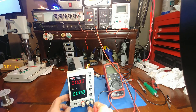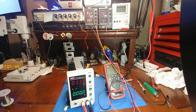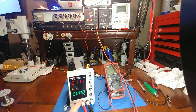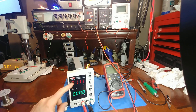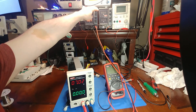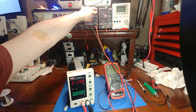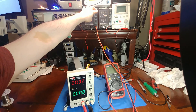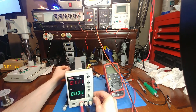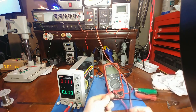I'm using my own power supply to feed it. It's turned on and now it's actually reading voltage — you can see it at the output posts. Let's see what happens as I turn it up. You can hear the relays clicking in, so it's switching into the different transformer taps. That part of it is working.